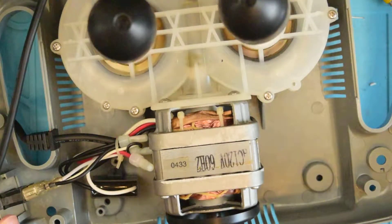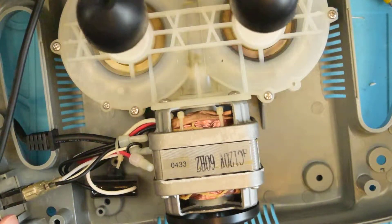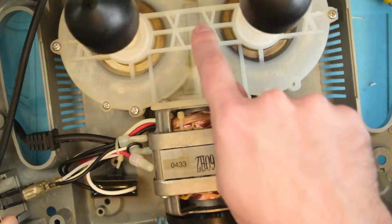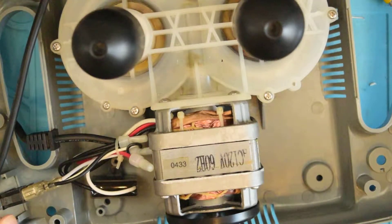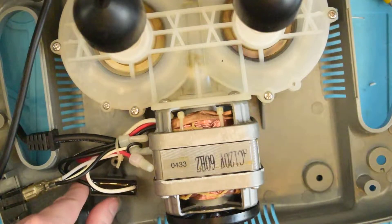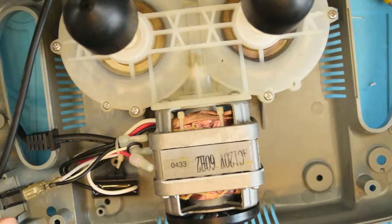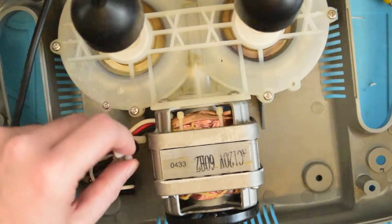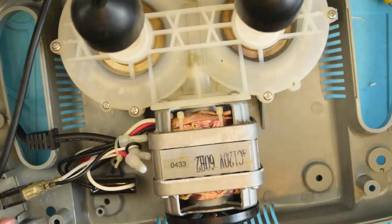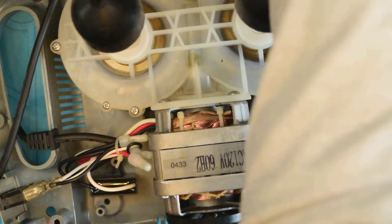This is what it looks like in operation — looks really kind of mildly suggestive. We've got the AC motor here, it looks like there's a worm gear and then some big gears along here, and you can make it go backwards. That's actually what this little motor-running capacitor is for — it makes sure that the motor goes one way or the other, if I'm remembering my motor control stuff correctly, but it's been a while since I did any of that.